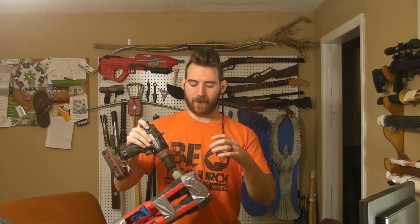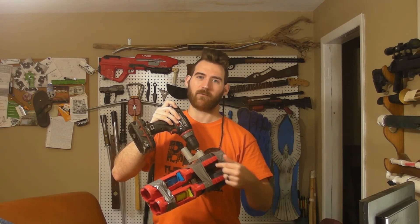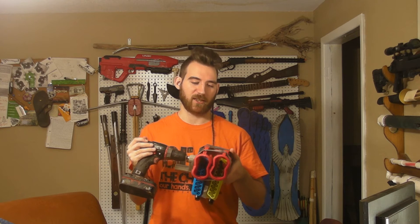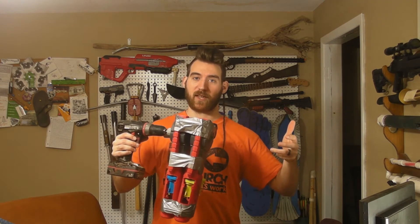It's another day and we finally got the prototype version working. Initially I was going to daisy chain all four blasters, each one powering the one next to it. The problem is that at its peak, it's holding the whole weight of the spring on the gears of one blaster but also holding the whole weight of another blaster's spring at the same time. With how much trouble it took just to get the gears to take this, I really don't think it's going to handle three or four. So the solution is to do the exact same mod on the gears of each one and attach them together in the middle.